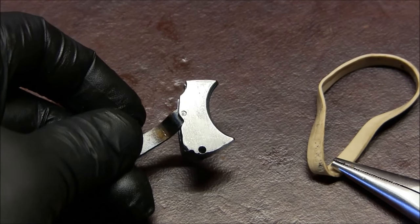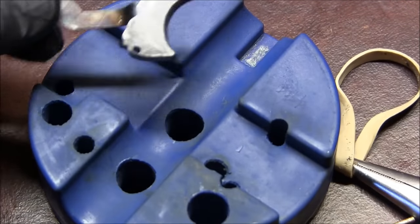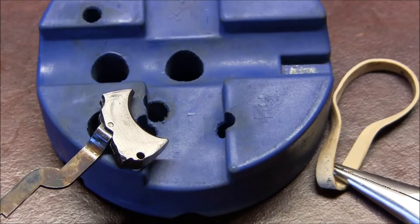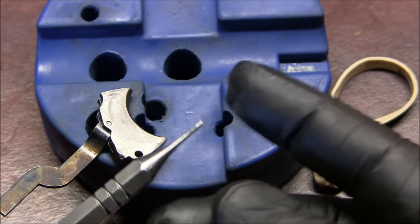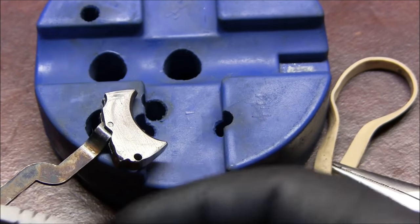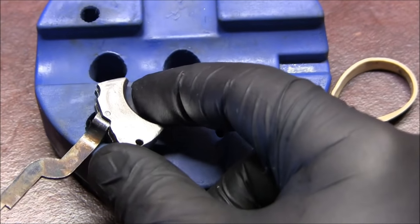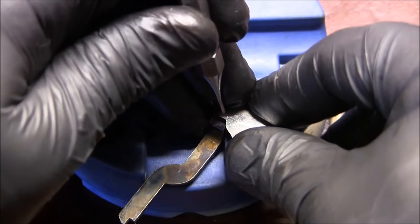At first the pin was almost impossible to see — you just had to find the outline. I'm going to take it out using a starter punch that I made. I took one of the broken or bent punches, the smallest one I had, cut it off and filed it down to be really thin and not too long — really good for driving out tiny pins that are mushroomed out on both sides.